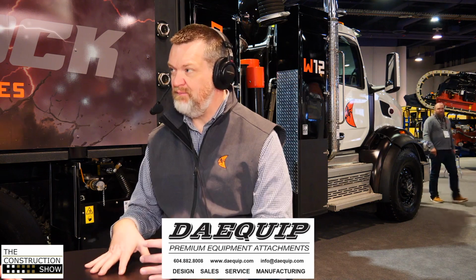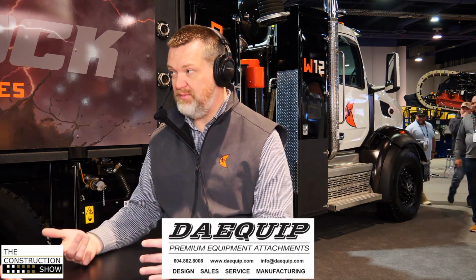Right. One of the best practices is you need to respect the unit. It's very powerful, so you need to make sure you're wearing the proper safety gear and using all the proper procedures, like making sure you don't dig with the wash wand. You want to start your hole small and then grow bigger. The whole idea for this is safe dig, so we want you to stay around 2,800 PSI. That's how we spec out the system. The system is set up for 10 GPM. You can actually run a dual reel, so we have a 20 GPM pump, and you can get 10 at each end if you need to. 2,800 PSI is where we want you.